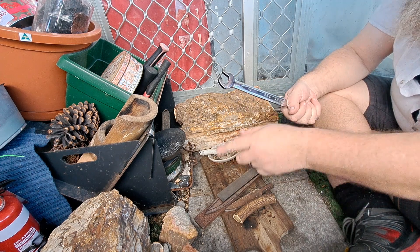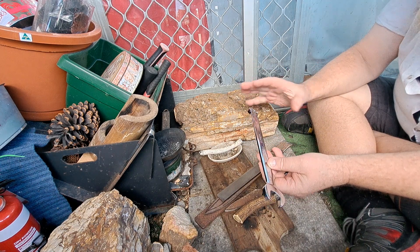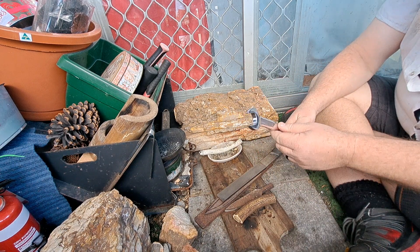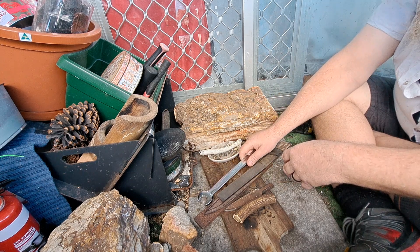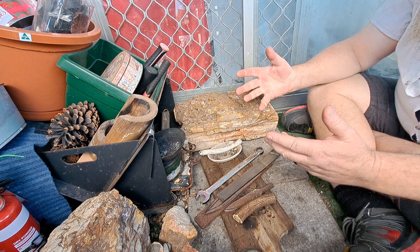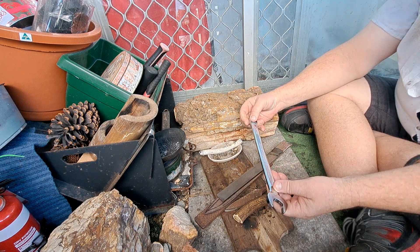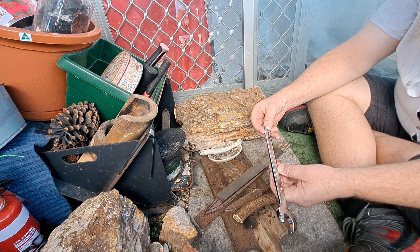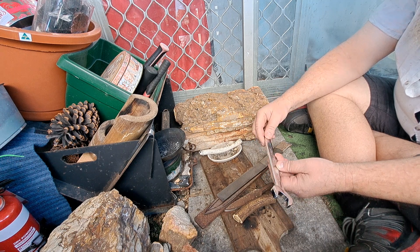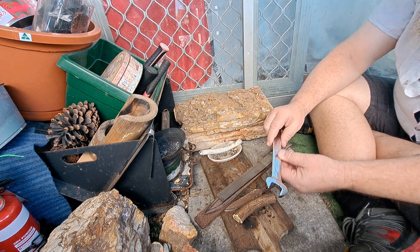That's why I wanted to do the karambit — it's an interesting, flashy sort of knife and there's a fair bit of forging involved. For 14 bucks it's not a lot of money. The steel is CRV — chrome vanadium — so it should be alright once I oil quench it, should be pretty hard. I don't know exactly how hard it'll be, but probably up around 60 Rockwell once I oil quench it.